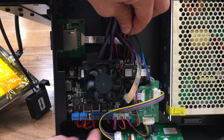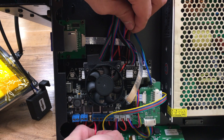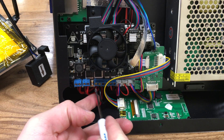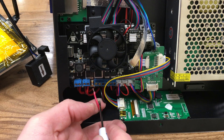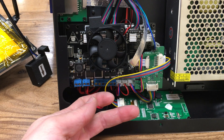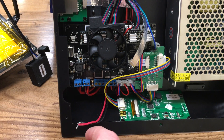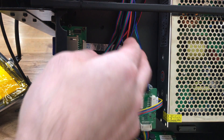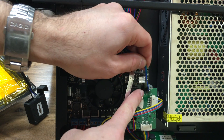When you move the cables up and down you'll see the two heated bed cables. We will remove those two: the red one is on the left and the black one is on the right. Take the screwdriver, loosen them up and take them off. Then follow the other two cables from the thermistor connection, which goes in here.